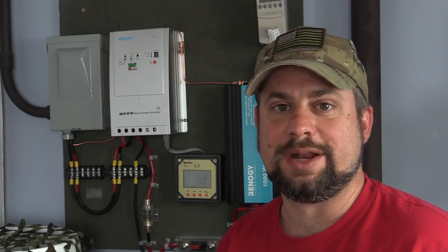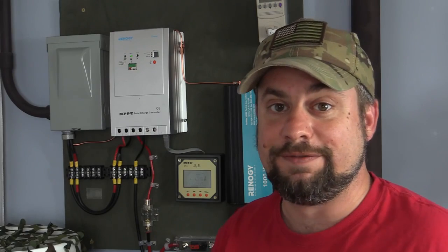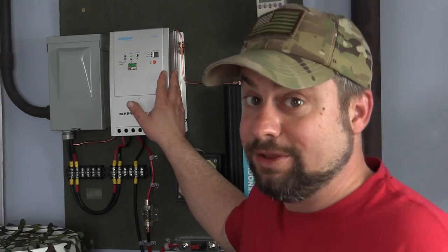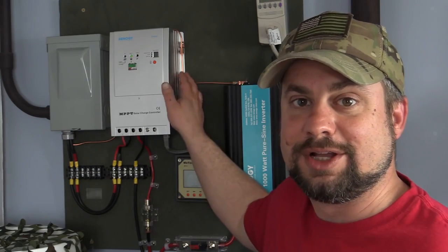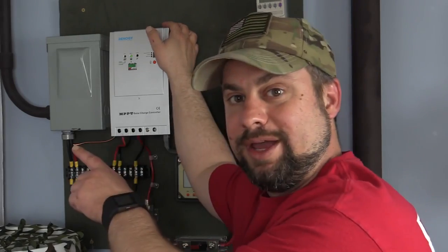One thing that you have to understand about electricity is, although it's lazy, it's always on the move and it's always going to find ground. So if this component becomes charged and I touch it, and I'm touching the ground, the electricity is going to travel through me. If, however, there's an easier path to ground, such as through this lug and out to the grounding rod, it's going to choose that way. Grounding is a must that will increase the chances that both you and your system will survive the apocalypse. And comparatively speaking, it's the least expensive component in the system, so don't overlook it.